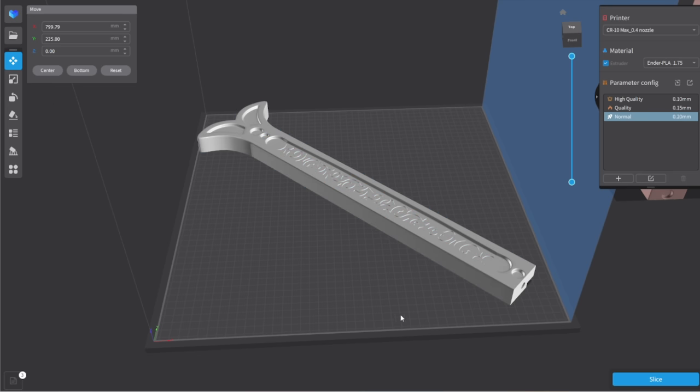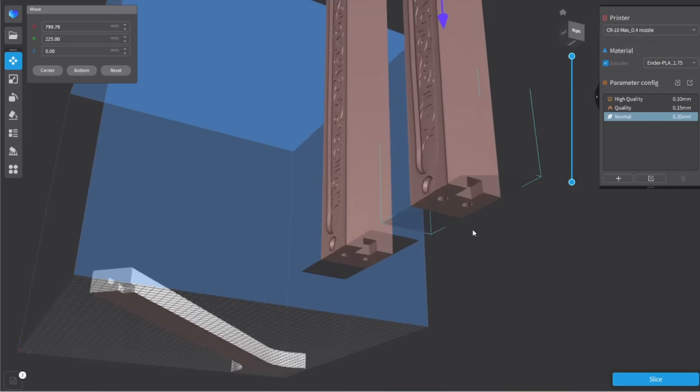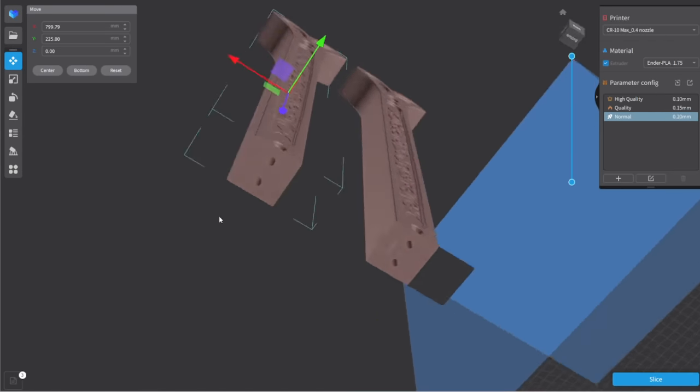This way I was able to go into settings and use the ironing feature on the shell to make the top surface really nice and smooth. If you can enable ironing on certain parts, it can really help the post-processing. Not everybody's going to have the luxury of being able to print this huge part flat — it almost maxes out the width and depth of my build plate. I sent two on my CR M4 and two on my CR 10 max. Just make sure you mirror them properly so you can actually connect the bottoms.